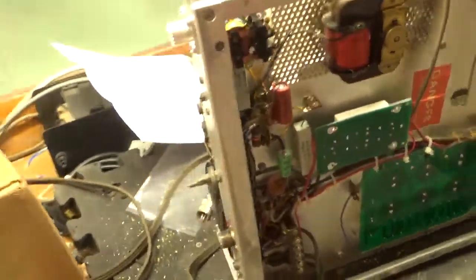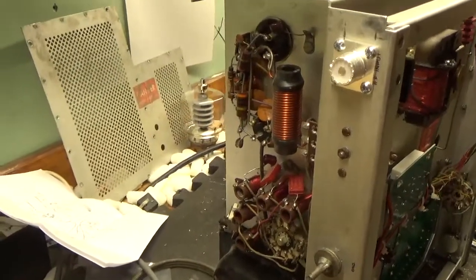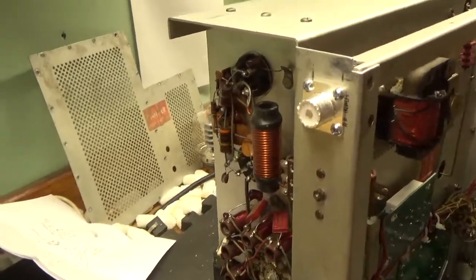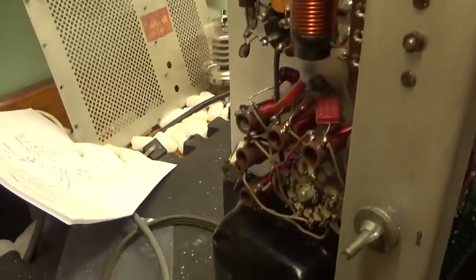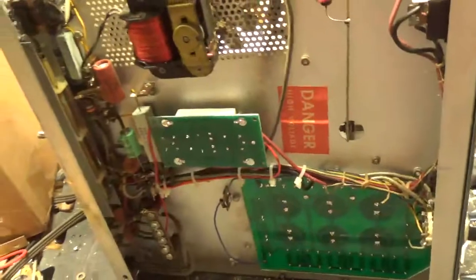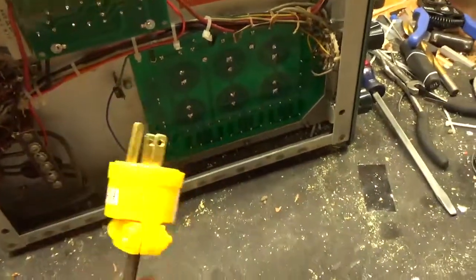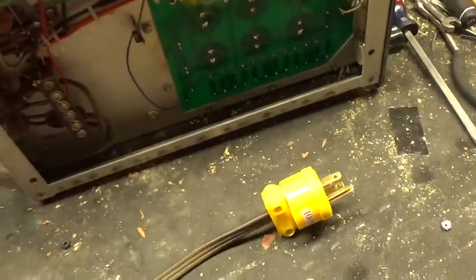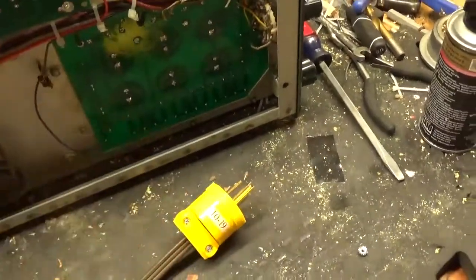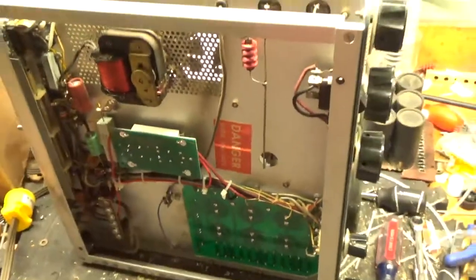So that's about it — this thing's ready to roll. Someone already changed the grid loading resistors, so everything else looks good, I don't see any other issues. I'm going to fire it up. I also changed the plug — put a new plug on the end. Here's the old cap. So this thing should last a long time. Thanks for watching. Have a blessed day. Take care.